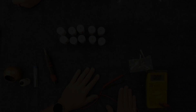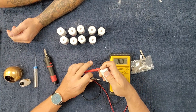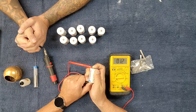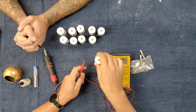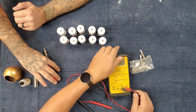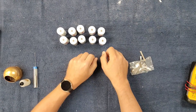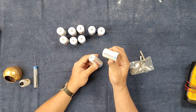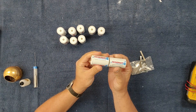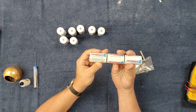Let's get started. Just to prove I wasn't lying, we've got our little multimeter here — which is probably something else you should have. We're just going to check the voltage on the cell. It's 1.2 volts, as you can see right now. Ten times 1.2 wired in series gives us 12 volts, which is exactly what we are trying to accomplish. Before we go any further, I want to talk about the difference between parallel and series. What we are going to be doing is series. Every time we connect positive to negative, the voltages add up.